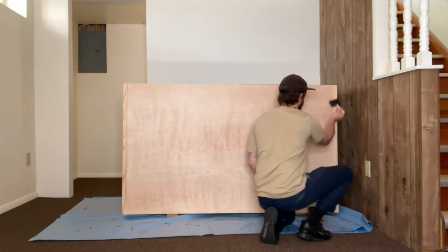Okay, problem fixed. I think that was a happy accident because those little corner bits definitely made it feel more 70s. Anyway, now that everything's all good, I'm gonna go in with a little pre-stain to even out the porosity in the wood, and then I'm gonna do two coats of the color American Maple. I honestly have no idea how this plywood is gonna take the stains, so let's go find out.